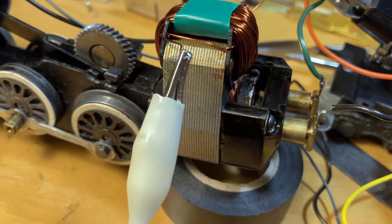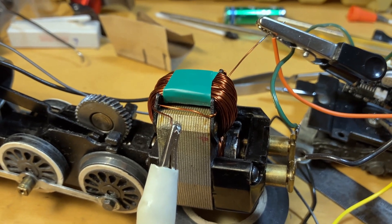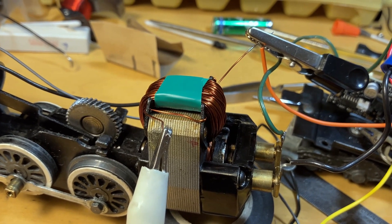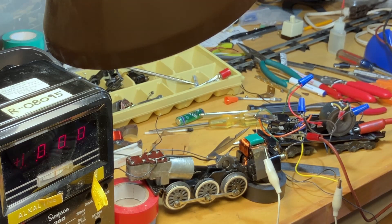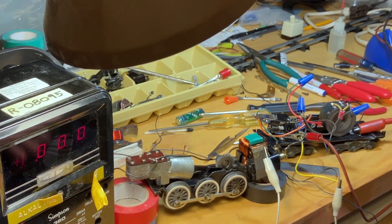It would wear off the coating and then short out. This is not quite 40 feet - the wrap was originally about 42 feet long, I took off about three feet and then another foot, so we're looking at 38 maybe 39 feet of wire on this. We're going to test this out and it runs most efficiently at 15 volts. Don't mind the wiring mess - I'll have that cleaned up. This is set to ammeter so it should show a reading of about 1.25 amps.